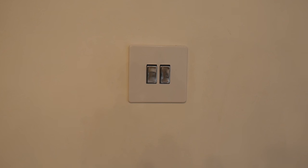So this is the light switch I'm going to be changing for the smart switch. Now, in the UK the problem we have is that most switches don't have a neutral. And a lot of smart switches require a neutral. So the one I've got does not require a neutral, so that'll be okay to install in most UK households.